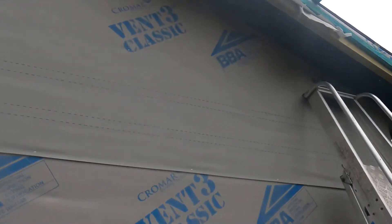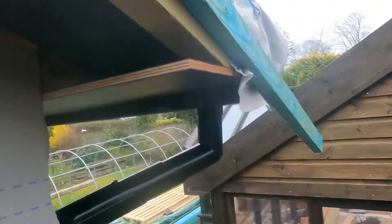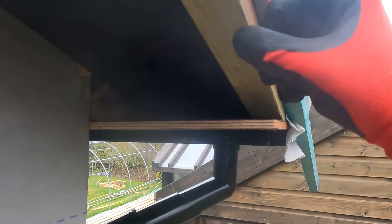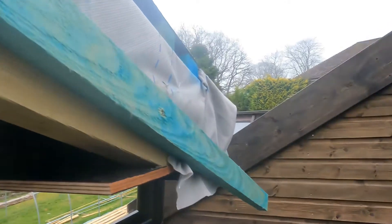I've just got to continue through the run — you can see nice even fixings all the way up. There'll be a little box detail here: a piece of ply comes up there, then 90 degrees off this, with a little fillet in there. The barges — we could only get them at certain sizes and the size I needed was out of stock, so we just have to live with those sized barges, which leaves about a two-inch gap down through here between this bit of C24 barge and the metal barge.